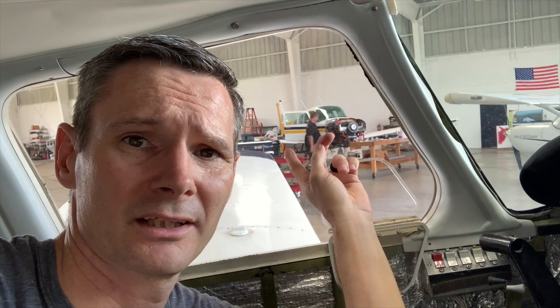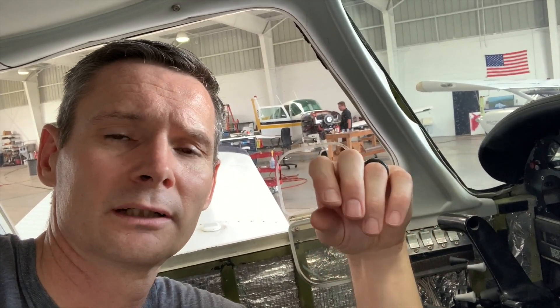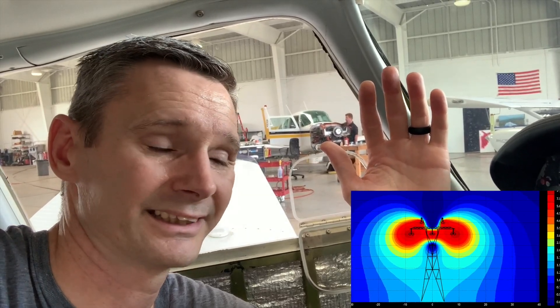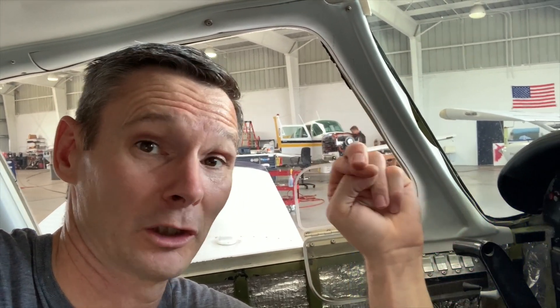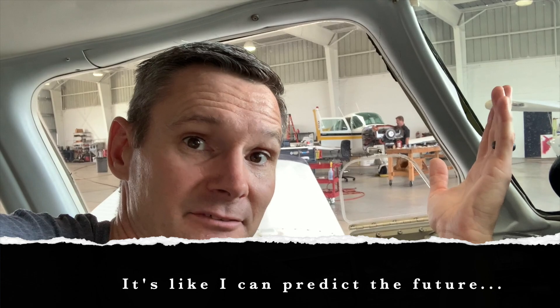I have the GMU out there inside the wing, just kind of sitting there connected where I think it's going to go. We have to do this check just to make sure there's no magnetic interference or anything like that. Fingers crossed, because this is the one part I'm nervous about. You test it, and if it tests good then you're home clear. But if it doesn't, then you've got to move it and test it again, and so on and so forth until you find a good spot where nothing is going to interfere with it.